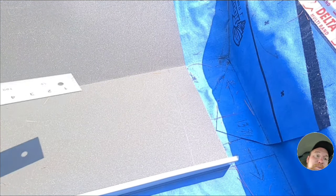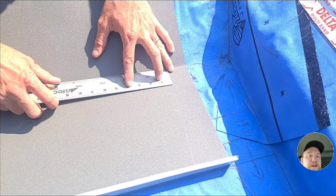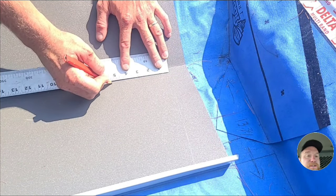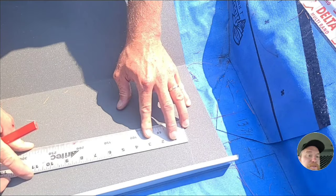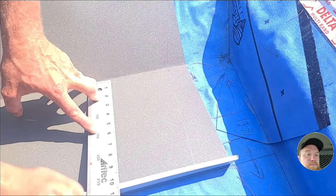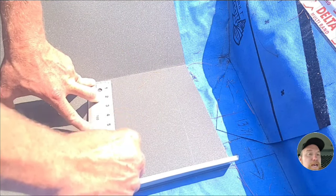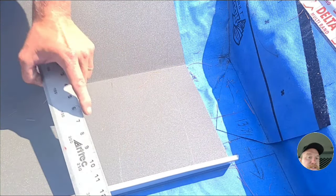Since I'm returning up the wall, I just grabbed a quick measurement off the wall, and now off my miter line I can just put in my allowance for my wall return. I know that it's going to follow that miter line that I had placed before.